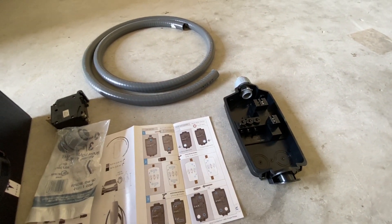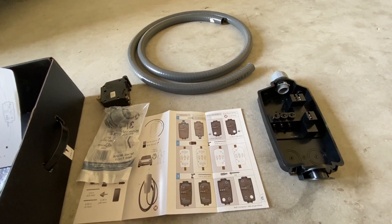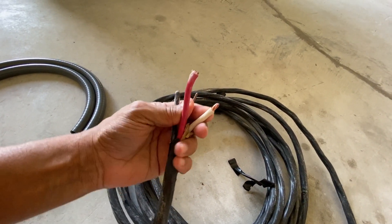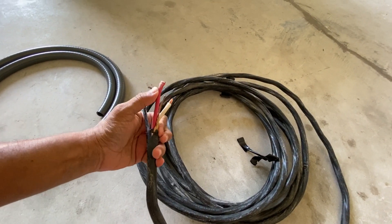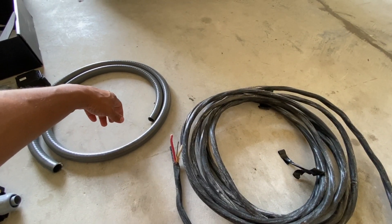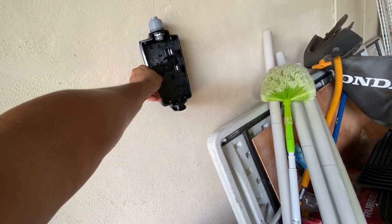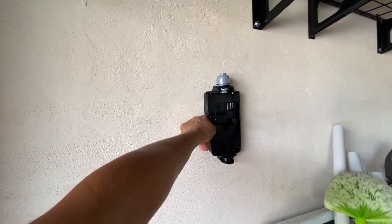For this configuration I'm using number six wire because it gives you the highest 48-amp rating on this charger. I have number six three-conductor wire, though we'll only use two conductors plus the ground. You can pick it up from Home Depot or Lowe's by the foot. First, figure out where you're going to install it — you don't want to be tucked all the way in a corner because you'll need room to coil the excess cable. I decided to put it around here where there's plenty of room.